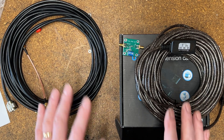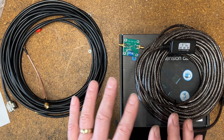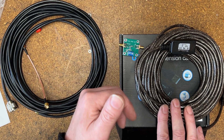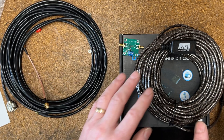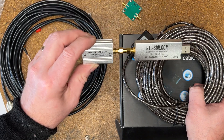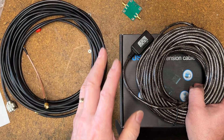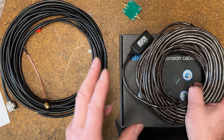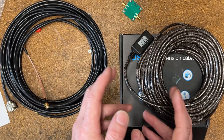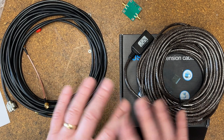There is going to be a part 3 — good or bad, there will be a part 3 — where I'm going to show you the final finished system. It's going to be on the main 1.2 meter antenna, with probably about a 30 foot mast to raise it in the air. I'm going to use a 20 meter active USB cable, and I'm going to try the RTL-SDR Blog with the LNA, but more likely I'll end up with a FlightAware on its own. There's a bit of hardware and lathe work to go on because I want to mount everything within the pole on the outside — a no-cable-show, just simply a pole in the air. That should be quite interesting, but that's a few weeks away.